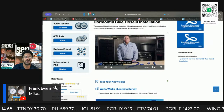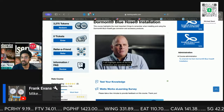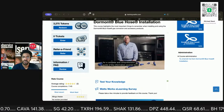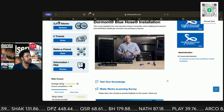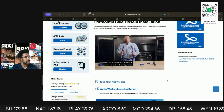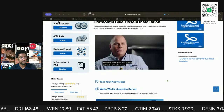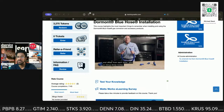Installing and using your Dormont Blue Hose and accessory products. I will highlight some of the key installation and operation tips. Please refer to the Blue Hose gas connector installation and operation manual for a complete and comprehensive guide of the information covered here. For an ideal Blue Hose install, keep these 5 things in mind. In order to reduce stress on the gas connector, keep the Blue Hose in a vertical downward U-bend configuration. Be certain to install the Blue Hose so that the end fittings are parallel, never perpendicular, to both the wall and the appliance. Keep the Blue Hose end fittings pointing vertically down and offset from each other, plus or minus 3 inches.